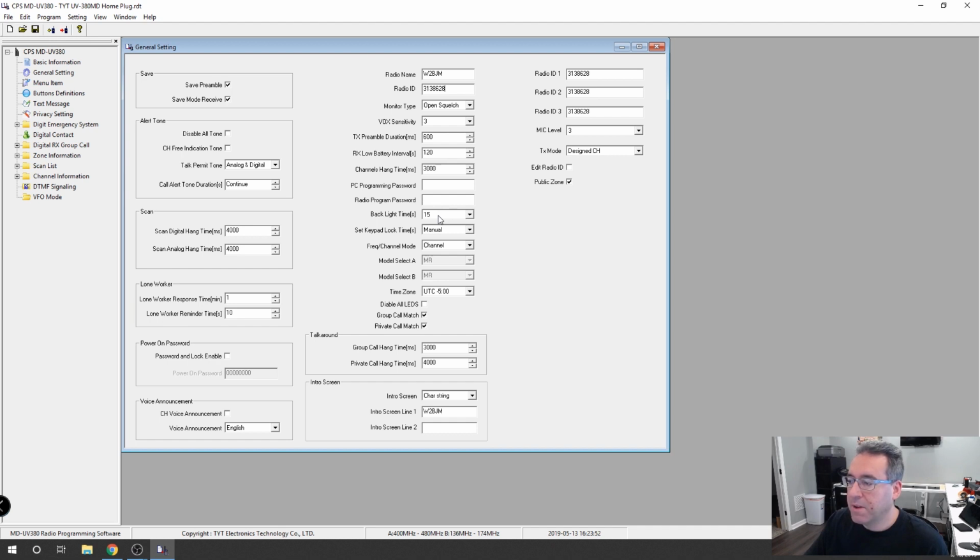Backlight time, I had mine set to 15 seconds. Hang times, these are mostly defaults. You can fiddle with these settings. The channel hang time is how long it will hang the channel open during a connection to somebody else to avoid having to stand up that connection later. You can see I've got channel voice announcement disabled down here. I mentioned that earlier. And that's generally it.